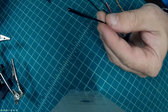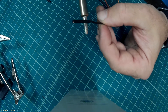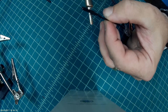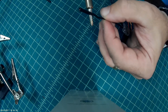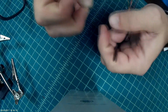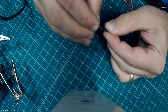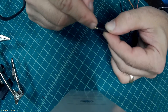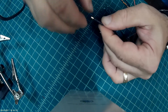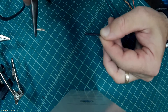Now all we do is take our soldering iron — which I should always keep clean but never do — and just add some heat to it. That should shrink everything up all nice and pretty. Then next time you need to check a motor, you can just disconnect the male end from that connector. There's the male end — she plugged right in. She'd have shrink tubing on it too, which would take us past the end of the connector. And that's that.